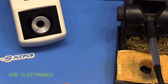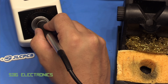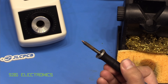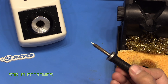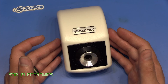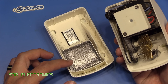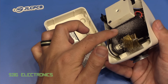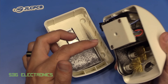The general operating principle is straightforward - you simulate having some solder on the tip and poke it in here. The motors start up and wipe off the excess solder. This one doesn't do an absolutely perfect job - there is still some solder on there, and you do need to give it a little extra wipe for a really nice shiny surface. Looking inside, it's magnetically held closed. The dish is supposed to collect all the bits of solder but it's not completely effective - solder has gone all over the insides and at the back, and could potentially reach exposed electronics.